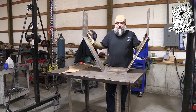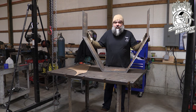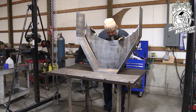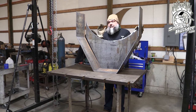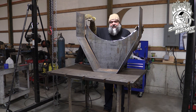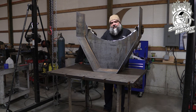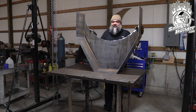Time to fit the skin. We do an initial stand-up fit to see where things are. We tack some temporary angle iron as a bottom reference, sit the piece flat on the table, and fit the top skin to it. This establishes the plane we want to end up at, then we bring the skin in and out to line up seams and tack weld. This size material and thickness is forgiving — don't be too intimidated if it's not exactly right immediately.